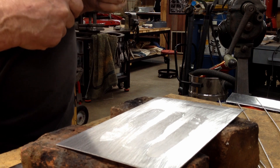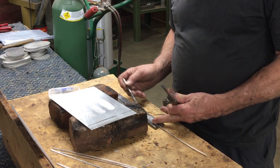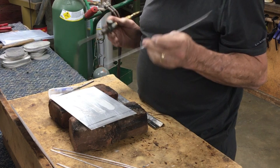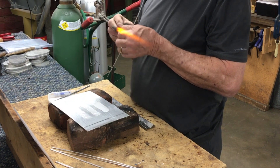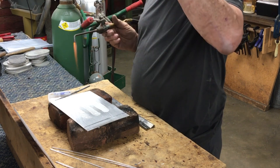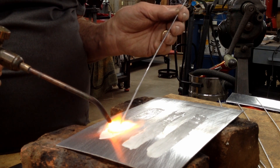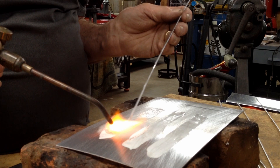I'm going to start off here. I've fluxed the metal, and I'm also going to flux a piece of the rod. A little too hot. I haven't had to do quite exactly this thing, so I'll have to hunt for a proper temperature. This is more like it — it should take two to three seconds to get liquid. It might be a little too cool right now because it's not going liquid.